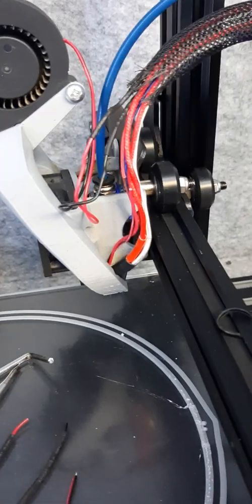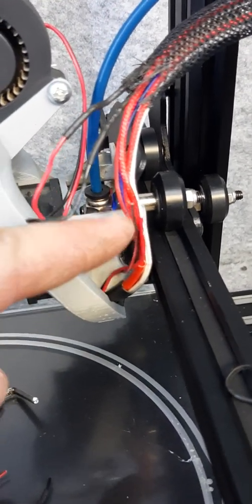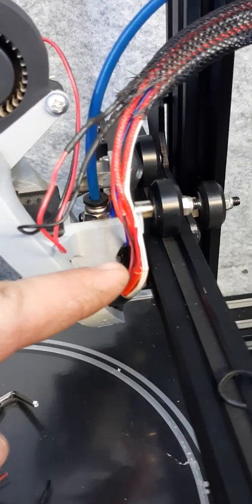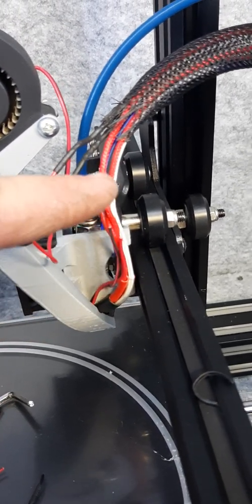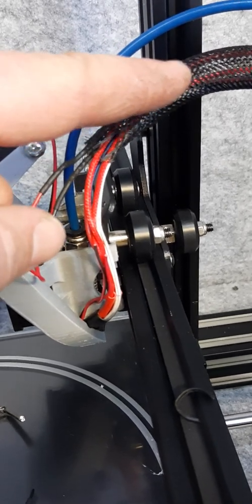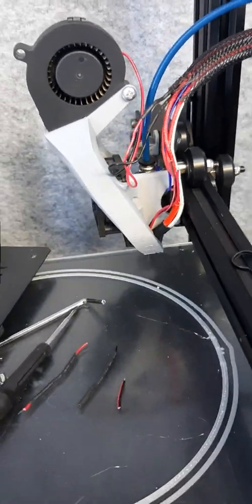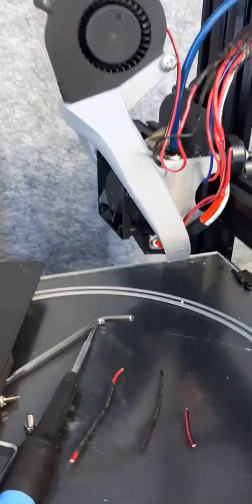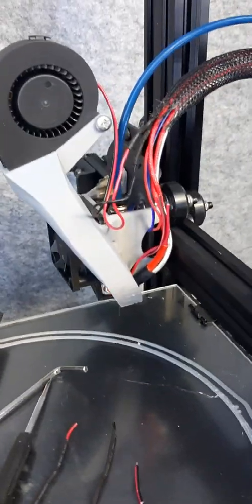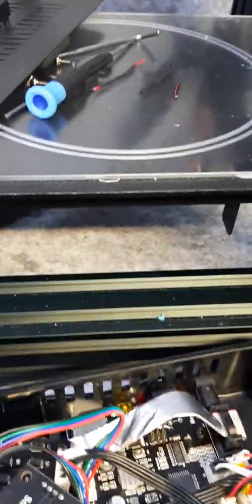What I'm going to do is put a solder joint even lower down, since I have to extend the wires for them to reach now anyway. I'll put the joint lower and then have good wire from there up, so I don't have any solder joints right at that pivot point. That should help it last longer and keep my hot end from having heat creep and melting up into the tube.